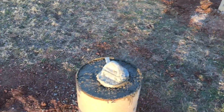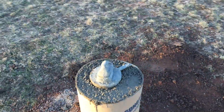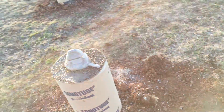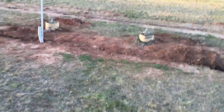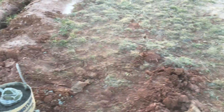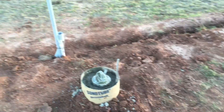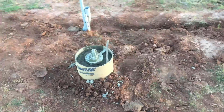These are the completed piers with the concrete in them. The concrete is mostly just to protect the metal pier and for aesthetic reasons — it's not really holding up that much weight. Here are the short ones. We're walking uphill so they're all level. This wire sticking up here is a grounding rod that we're going to tie the container to, just to make sure.